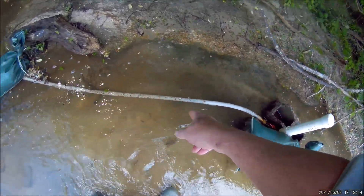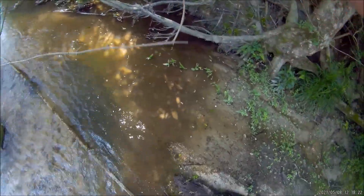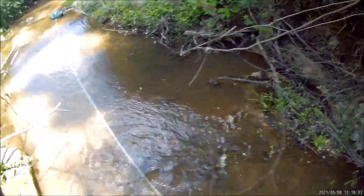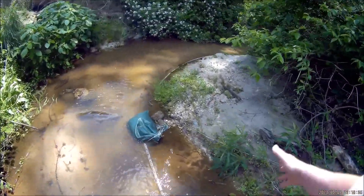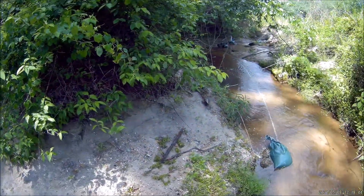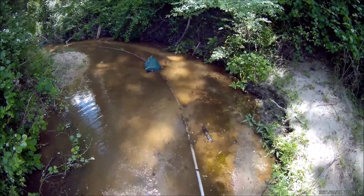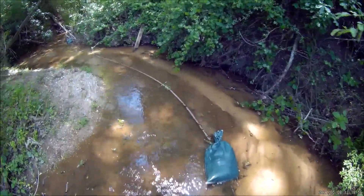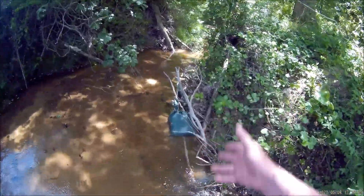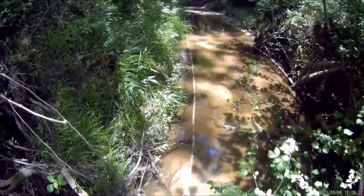For my delivery line I just got some three-quarter inch heavy-duty garden hose. What I like about it is that it's flexible — it can go around these snaky turns. About every 50 to 75 feet I've just laid a sandbag on it; there's plenty of sand around here, and that helps keep it from washing away. Just think of how much it would cost to run a supply line through here with all the angles. I bought this hose for less than 30 dollars per 100-foot section, and I've got close to 400 feet of hose just running through the creek.